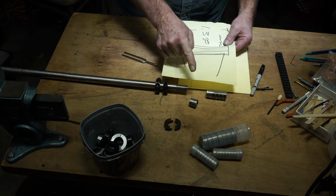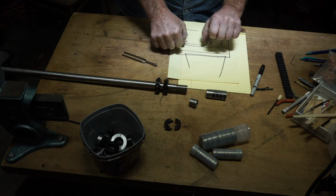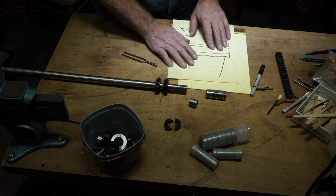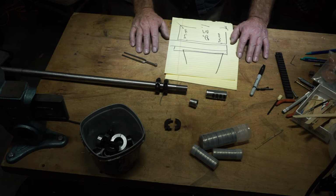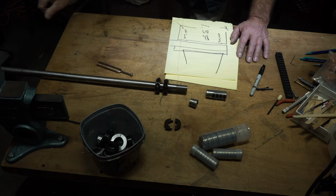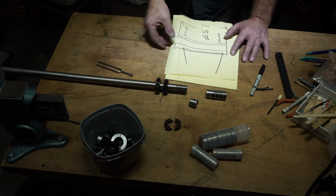It is also number two about maintaining the vibrations through this assembly, getting it to tighten up tightly enough that not only can it not shoot loose, as in boom and move, but also that it can vibrate and vibrate and vibrate. Now, anybody who's been around nuts and bolts and cars and machinery understands that nuts and bolts tend to vibrate loose. The fact that they tend to vibrate loose says one thing. While the effect may be small per second or per cycle or per unit, over time bolts and nuts will vibrate right off their shafts and a baler will break down out in the field.